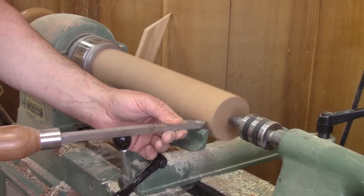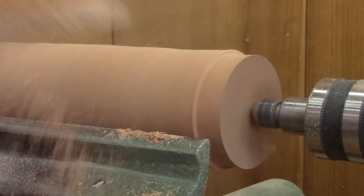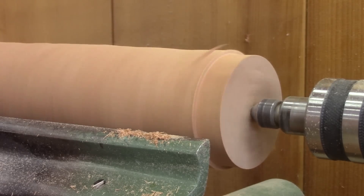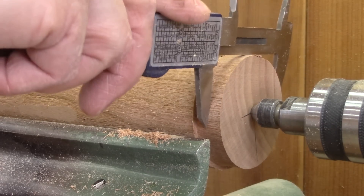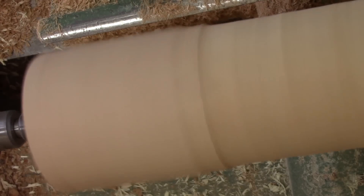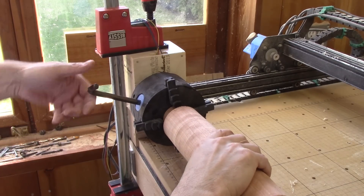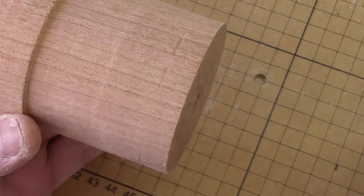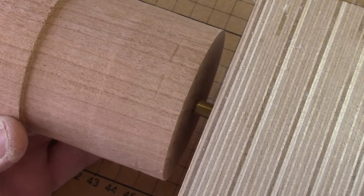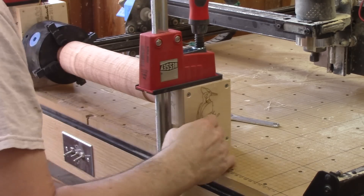In fact, it doesn't really need to be round. I only need to have one end with a diameter of exactly 65 millimeters — this will become clearer later on. Then it's time to turn the blank round, turn the rest round, and cut a smaller tenon at the other end. This is necessary to be able to chuck it on my fourth axis. Finally, I can use it for something useful. And now that it's in place, I can cut a pole.